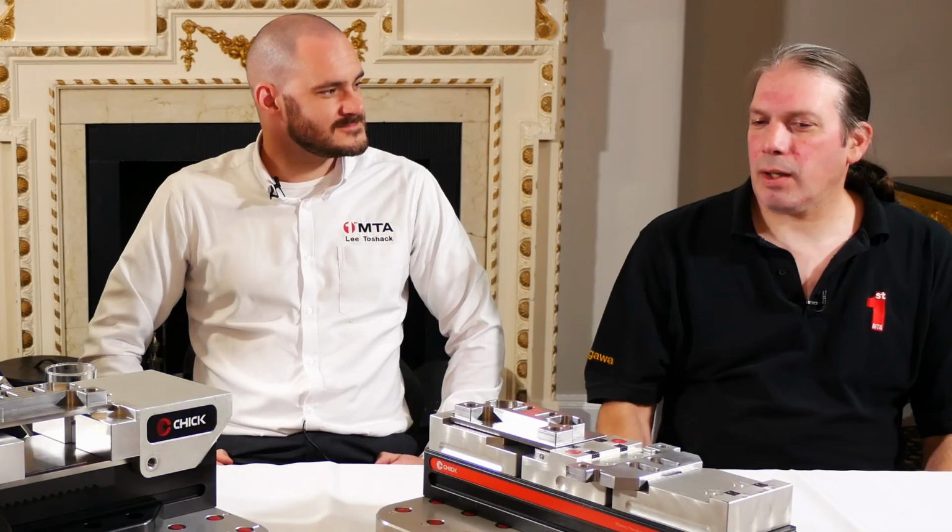Yeah. So because it's expanding, I would imagine then there's zero clearance between the pin and the foundation once you've tightened it up. Yes. So the only clearance you then have is whatever goes onto the pin. So you kind of eliminate a layer of potential error by doing that. So you don't get that stacking up of tolerances. It's minimized, yes. Minimized, yeah, okay. Pretty well thought out system.